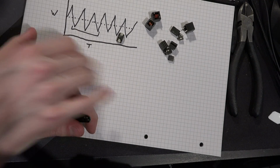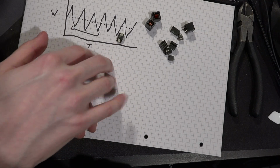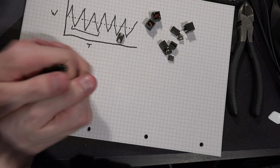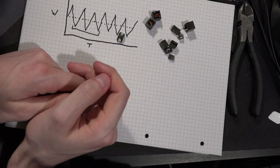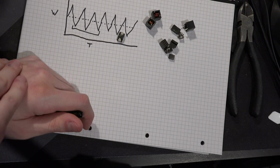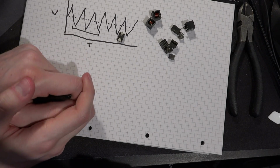But at the higher frequencies, also our hearing is more sensitive to a certain kilohertz range. So at the higher frame rates, that's when you're going to hear most of the coil whine, because that's when the inductors are going to be vibrating at a frequency we can hear better, and also where the core has an easier time actually doing the movement.